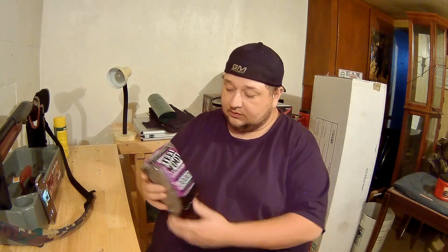If it doesn't work, we'll send it to the gunsmith, but we're going to try anyway. What we're going to use today is Super Blue. I got this on Amazon for a couple bucks — I'll put the link in the description. I also picked up their cleaner degreaser because in order to blue, you have to have all the grease and everything else off the gun. We're also going to use some four-ought steel wool. It's very important that you use four-ought because it won't take the bluing off, but it will take the rust off as long as you keep it oiled during the process. So stay tuned and I hope you enjoy the video.